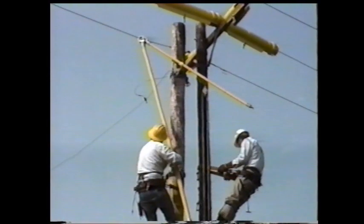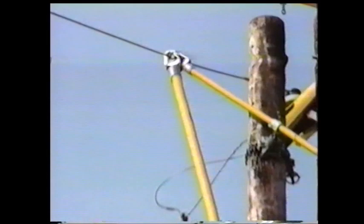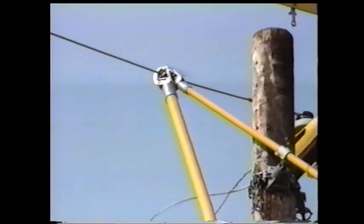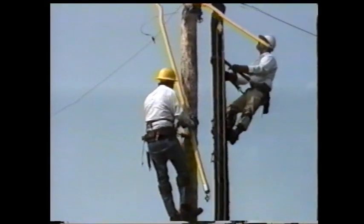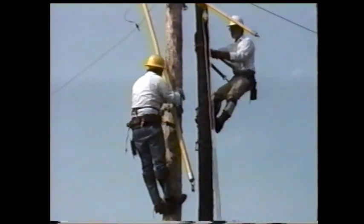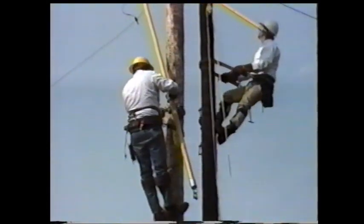The 2.5-inch by 10-foot wire tong is then placed next to the first wire tong on the line and tightened. It is then secured to the 2.5-inch pole clamp. The pole saddles must not be too close to each other, or you will not have complete control of the phase as you move it out from the pole.